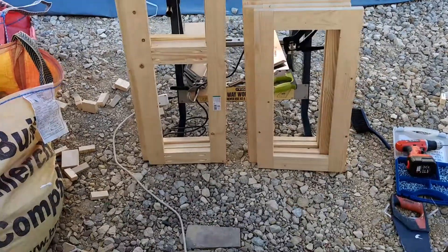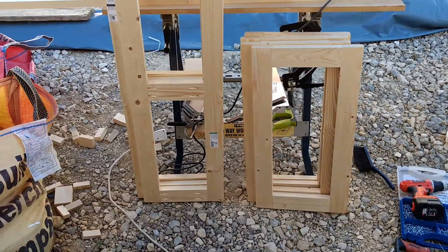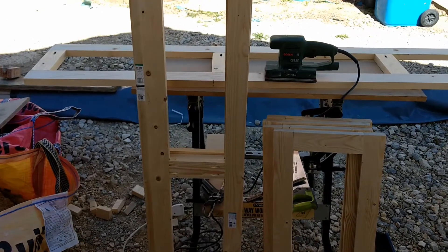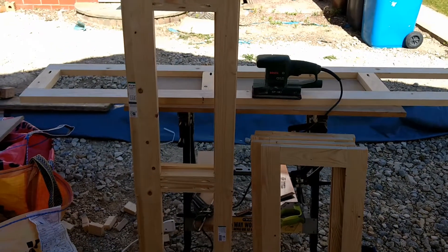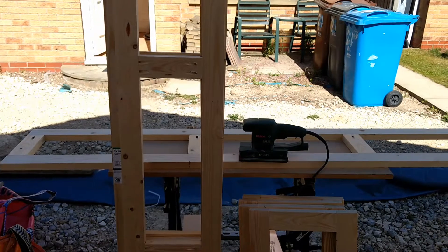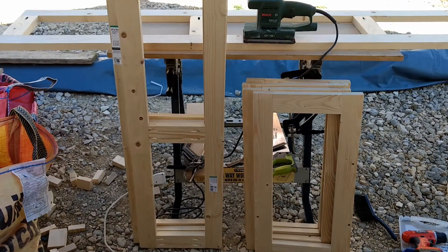The frame is finished. That's basically it — four long pieces, four short pieces. Dead simple, really easy to do. I'll just give them a good sanding down, make sure there are no rough edges. Then I'm going to see what edges I need to route. I'm going to have a mattress sitting inside, so I don't want sharp edges where the mattress sits. I'm going to route along a couple of edges just to make sure it's nice and smooth. That should be it for today, and tomorrow I'll put it all together and start setting up for the drawers.